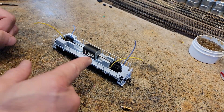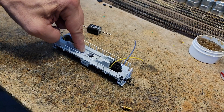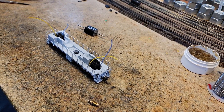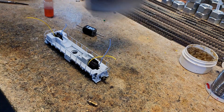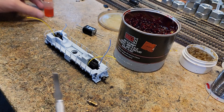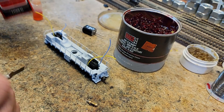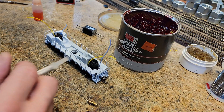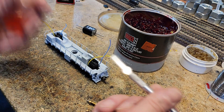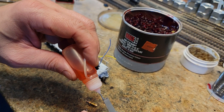We're going to back off on these shafts pretty far. I'm going to fill in this little gap with a little piece of lead so that it's level. We'll take these worms — it's a Mag 1 and a number 17 blade with our Marvel air tool oil. As I've said before, do not buy the small can of it. Get the quart because the small one is like seven bucks and the quart's like ten. You can get some droppers put in there. I want to put a drop on the end of this blade and get just barely on this side.